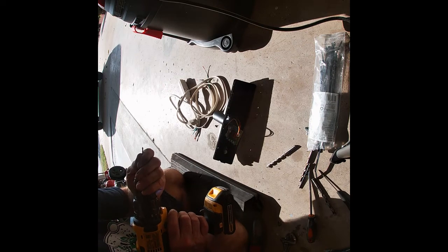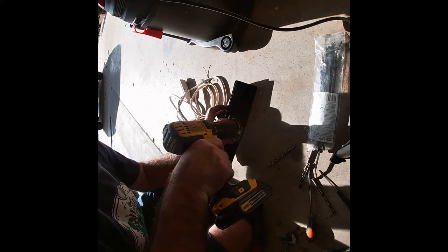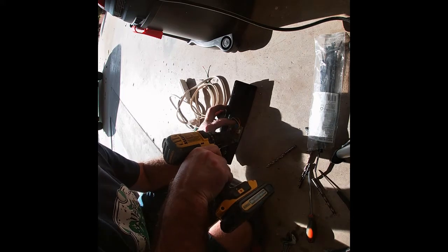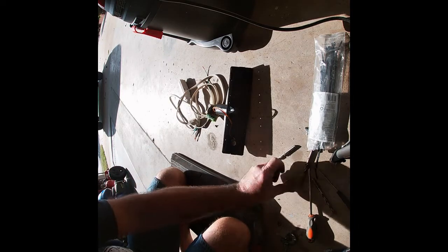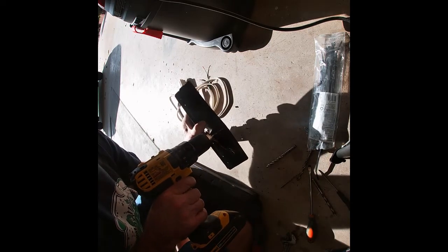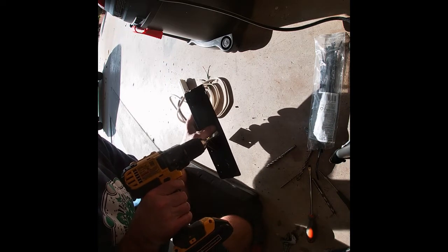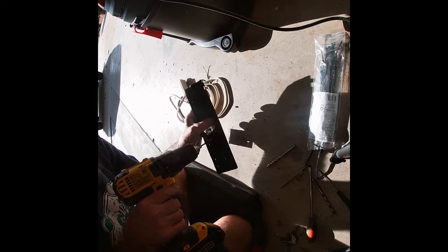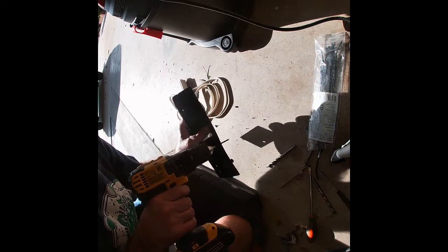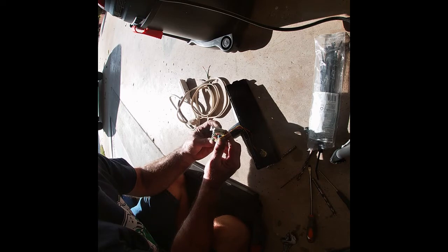I get a small drill bit so I can fit through the PCB board, then I change it out for a bigger drill so I can put the screw through it. That plastic was quite hard to drill without having a burr or it flanking.